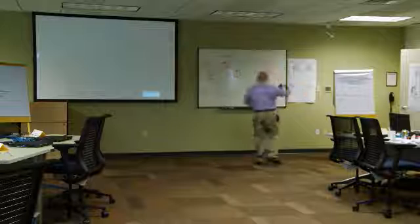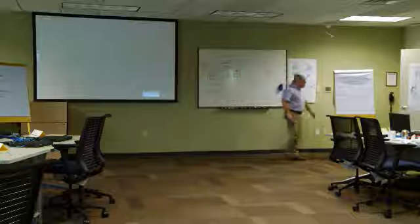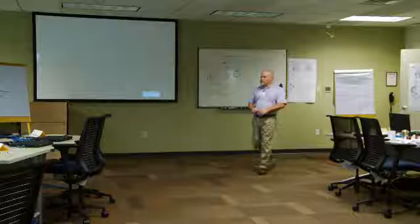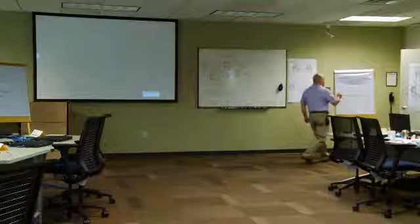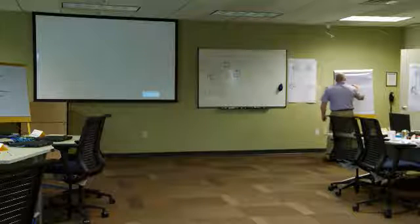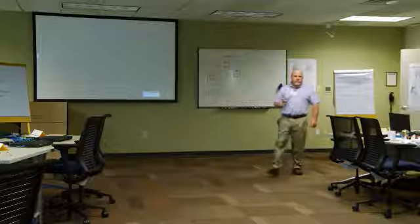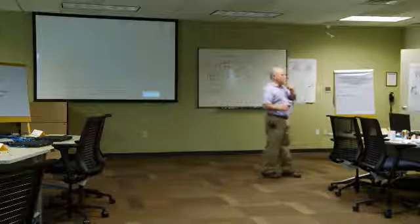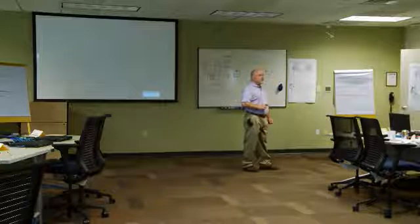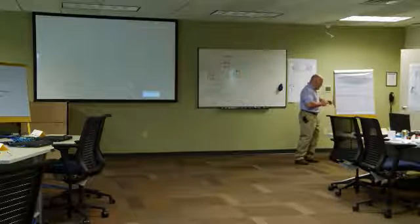So going back over here, I asked you guys, as kind of a summary to what we talked about, why temporary safety grounds? Steve, give me one answer. Okay, personnel. That's number one reason. Personnel safety. We like Eric. We like Dave. We want them to come back to work tomorrow. We want to protect them, right? Joe, what's the other reason we mentioned? Keep that equipment grounded at zero voltage. That kind of answers this question, right? How something stays at 0 volts.